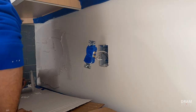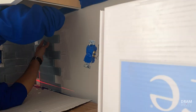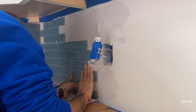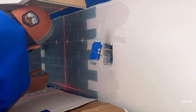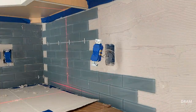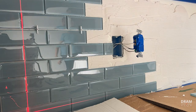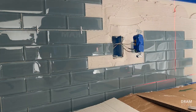Let's set more tiles. Setting the tile is simple — you use the flat side of the 3/16 trowel to spread your adhesive, and then you use the notch side to directionally trowel the adhesive. Then you simply pick up your tile and set it on the wall. You can use spacers to keep a gap between your counter and the tile, and this gap can be filled in later with caulk. This creates a small gap that allows for expansion or movement between the countertop and the backsplash. Once you set your tile, use a float to gently press it in to make sure it's perfectly set, and then repeat the same process.